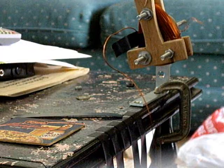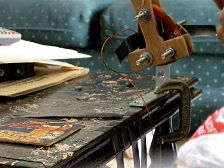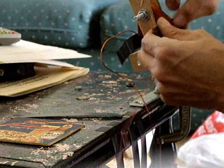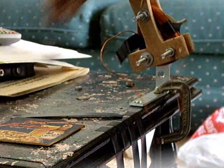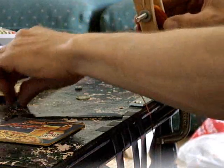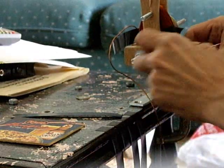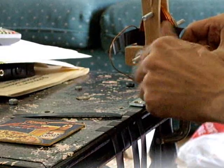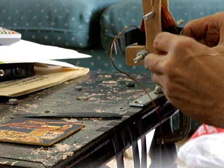Get the tool, stick the tool right through, grab your tape, pack the tape on, pull it through, hold it over nice and tight, keeping your coil tight. And there you go — now you can take your coil out of the form. It shouldn't take too long. And if you're only winding nine coils, it really doesn't take a long time to do this, especially if there's one or two of you doing it. Two or three helps.